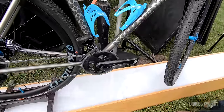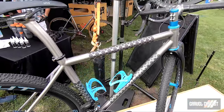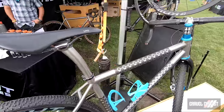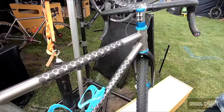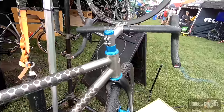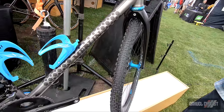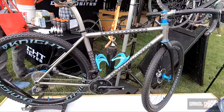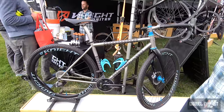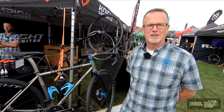What we do is acquire all the tubes — they're U.S.-made tubes — and they're sent out to California where they're laser cut. Then they go off to another facility where the carbon is inserted, bladder molded out, and then turned down. Tubes come back to us and that's where we weld them. We weld them in Boulder, Colorado. Thanks for coming by — check out our website, merlinbikes.com.